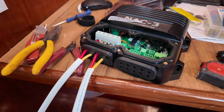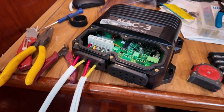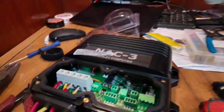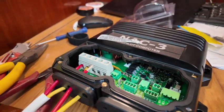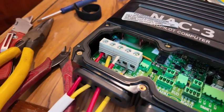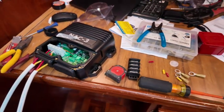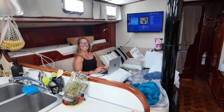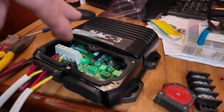The autopilot project is coming along, but I had to run to West Marine again. I went to get the specific wires — right colors and everything — and I come back, strip it, and it's red and yellow instead of red and black. I'm so pissed at myself for not checking that. Also, these little connections are super tough to get wire into without fraying. What I did was dab a little bit of solder on the tips — that keeps all the strands together pretty nicely.